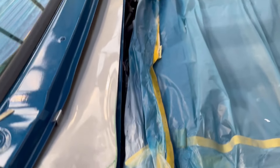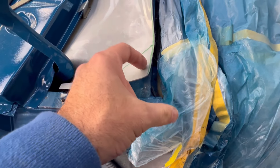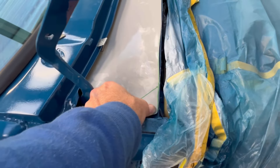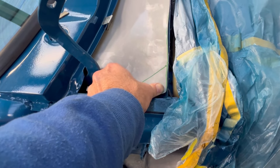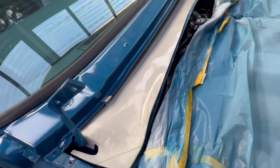I'm going to have to heat that up to try and change that shape, and it's the same on both corners. You might be able to push it down like that and maybe a small hole in there just into that lip — that'll probably be the best option to give it some hope. But it's still totally the wrong shape so it does need to be bent a little bit. Because it's one mil I can maneuver that with my hands to get it into the right shape, so that's what I'm looking at doing.